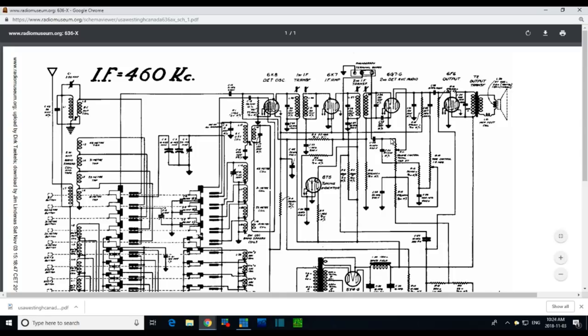But if it were leaking, some of that negative voltage could get through here. And by the way, it certainly looked like it was quite capable of being leaking. I did not test it for leaks, but I think we can assume it was definitely leaking. So some of the negative voltage gets in here and ends up on the grid here, causing it to be more negative than intended. You know, I'm kind of making this up, but that's what I think is going on, causing it to be more negative and quieting the operation of this triode here, which would quiet the whole output in the rest of the radio. So I think that's another factor here. I think I noticed I went from having the volume up really high most of the time to having the volume set pretty low. So, okay.